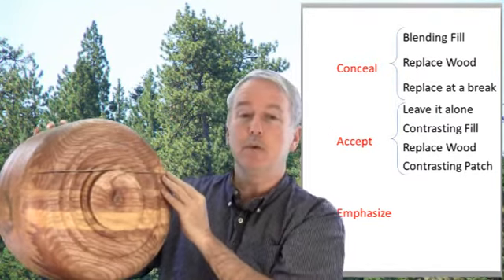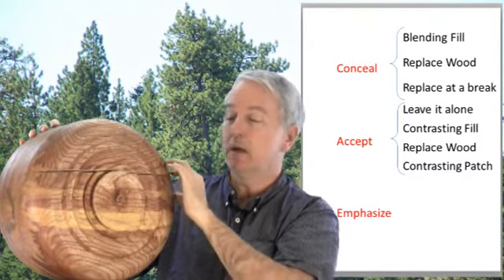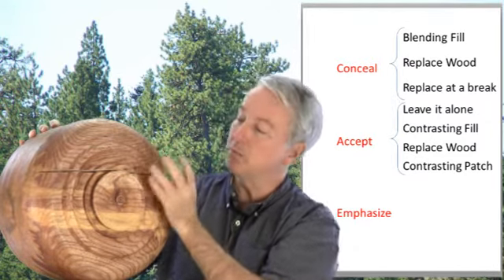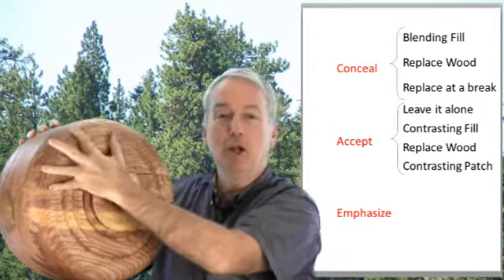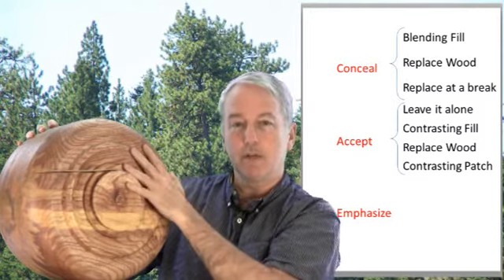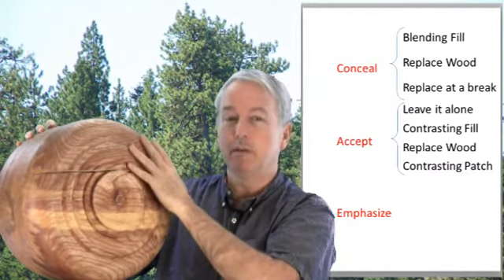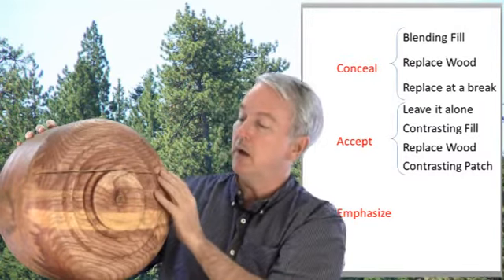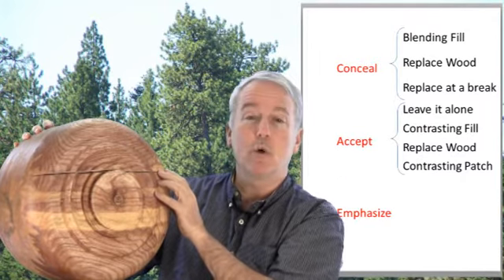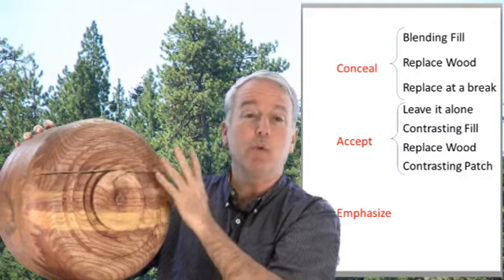You may also route or saw it out, but use a contrasting piece of wood. Even more drastic would be what I'd call a patch wood — not square or rectangular, but a more irregular piece that patches the area, possibly requiring a couple of overlapping patches to cover the split, but not blending in — at least somewhat contrasting. An example of this is Hawaiian calabashes, cited in one suggestion, where the end result is actually quite beautiful.